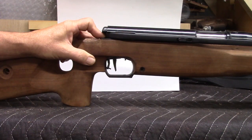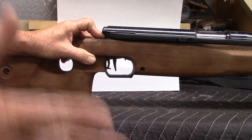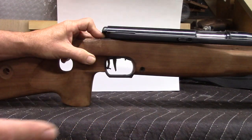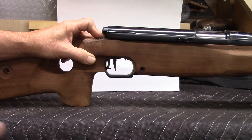Over the last week I got my vacuum system set up. That's the high pressure, high negative pressure vacuum system I use for vacuum bagging carbon fiberglass, carbon fiber stuff. But since I moved into the shop, I haven't really set that up yet. So I did get that set up, and we use that to evacuate the air out of an epoxy slurry mix to get rid of all the little air bubbles in it. And frankly, I think it'd be a really cool project to do. I'd like to show you all. I'd like to give it a try and see what kind of results we get.